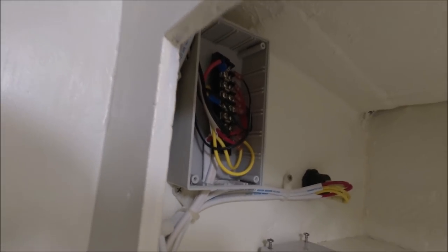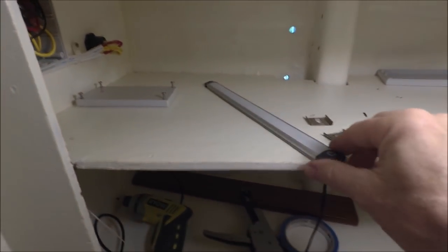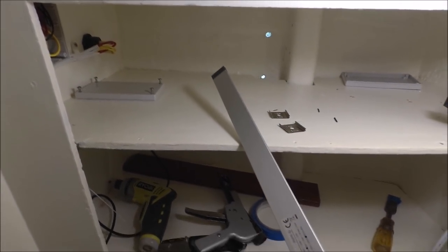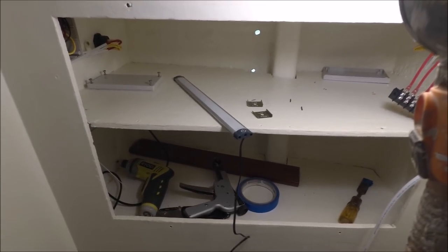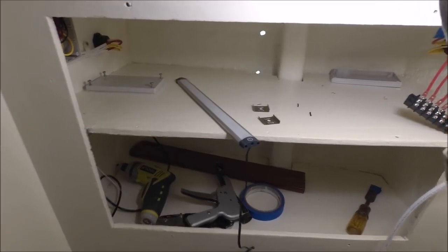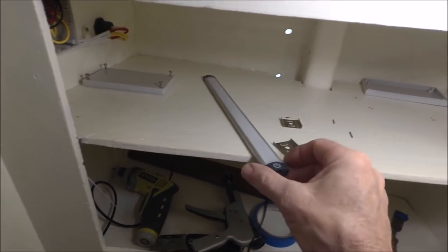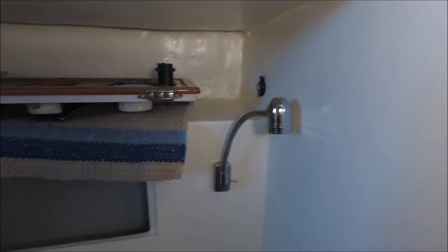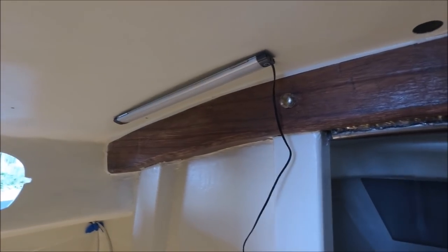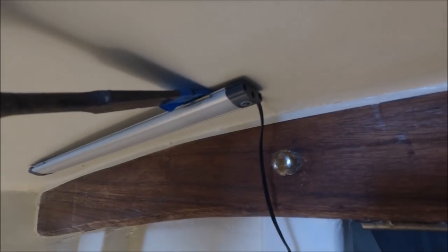There's the lights and fans circuit. We're installing these marine beam strip lights — they're $25 each and come in three brightness levels. Push this sensor button once for low, then again for medium, and third time for bright. They mount with these little clips. I had to drill out the center holes because the screws they supply are too tiny to fit into fiberglass without breaking. Got that installed — so that's kind of an area light, and you also got a reading light there. In some cases you might need to put a few washers behind the clip and hold down on the clip with a chisel while you press it to snap it in place.